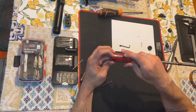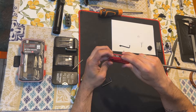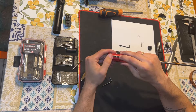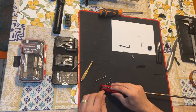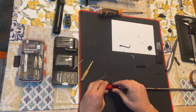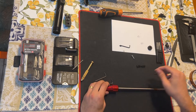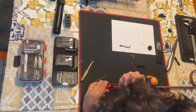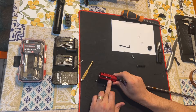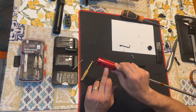Once inside, you will know it is placed properly because it will leave just a little bit of slop — it won't go directly down, nor will it stay up. We will place the retention pin and try to fix it properly, making it go a little bit deeper. I do not recommend putting it all the way in, since for me it was a pain to get out — I had to punch it out using a vise.